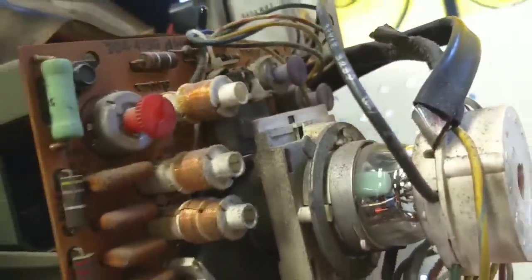And we can see the blue line move up and down until we get it on top of the red and green one. And if you, this one doesn't need it, but back here is what you call your blue lateral adjustment. That's that magnet on this collar here. This one slides up and down. Usually with a thumb wheel. That's that guy right there. So, if we turn the thumb wheel, you can see it go from left to right. This one's frozen in place. I don't want to break it because I don't need to do anything with that.